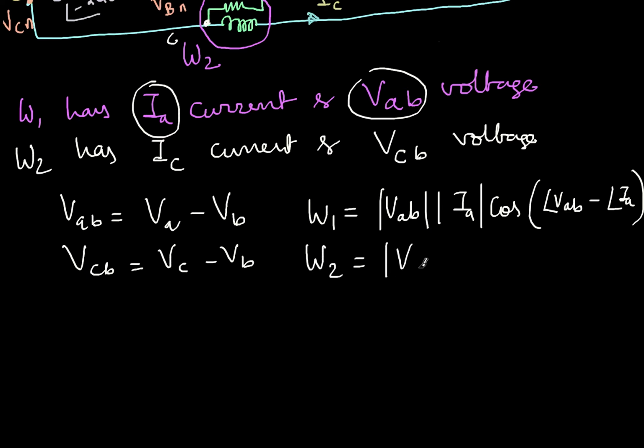So what is PT? If I go back to the same circuit, for this 5 ohm load and everything, the total power we were getting was 4422 watts for a 3-phase, 3-wire system. So this should be equal to 4422 watts, which is what we need to verify now. It's just a power measurement, the 2 wattmeter method. Since we are not conducting the actual experiment, let us write a small code to get these values. So if I now go back to my code,